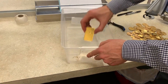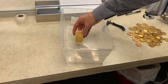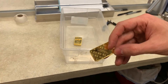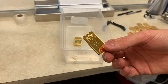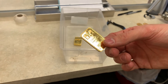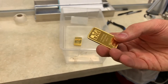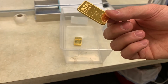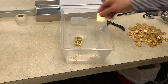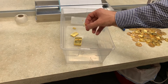It's looking good. If it was all white on the inside, we would know it was filled with tungsten and it was no good. I haven't had any issues with the one ounce bars that weren't able to be identified via the x-ray fluorescence spectrometer. But if you don't have an x-ray fluorescence spectrometer and you really want to go for absolute maximum safety, you may choose to drill the smaller bars as well. I choose to drill the bars above one ounce.